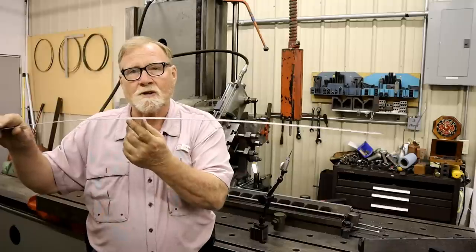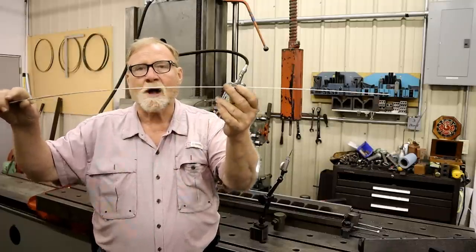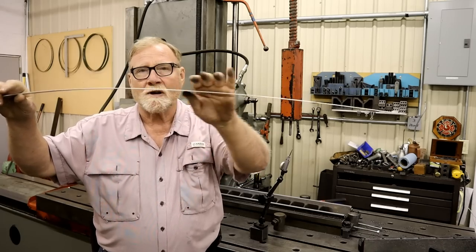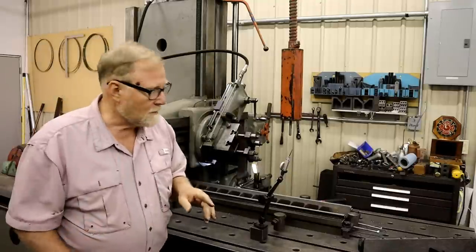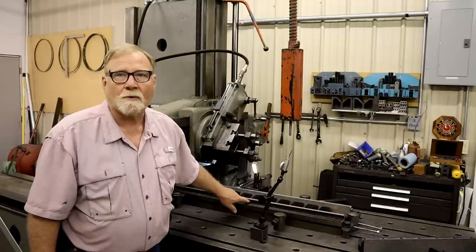And as you peen those T-slots by tightening things up on those T-nuts, it stretches the top where the bottom stays undisturbed. Well, this stretched top makes the whole thing bend over years. And if the whole thing is bending, this surface in here is certainly bending also.